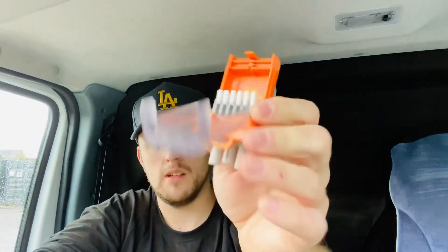Let me show you these light fittings quickly. You don't get the bezel with it — you buy them separately, about two quid, and you can get different colors. You get the pro fitting and the connector. It just plugs in — you connect up with little in-and-out push fitting connectors, then just clamp it down. You can leave them hanging out of the ceiling whilst you do your testing because these are an integrated LED fitting, so you can't remove the lamp, you remove the whole thing. It's also good for the plasterer who's going to overboard the ceiling — he can just unplug them and pop them back up into the loft without smashing our light fittings.